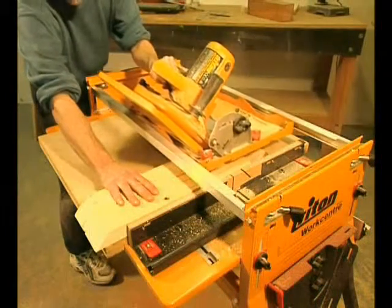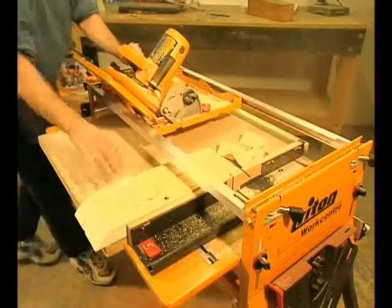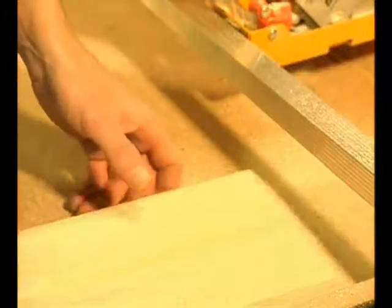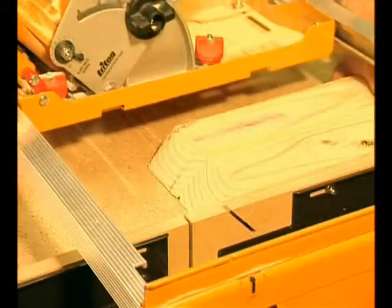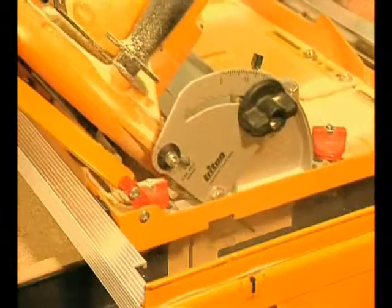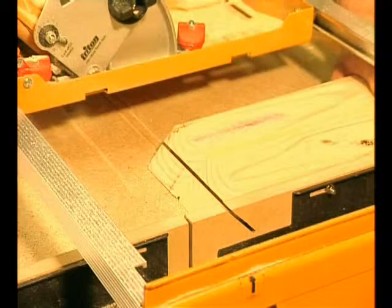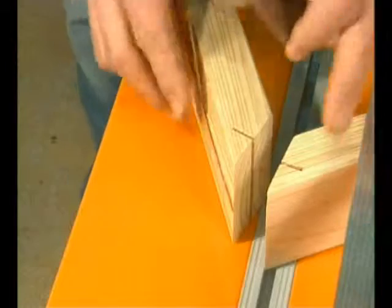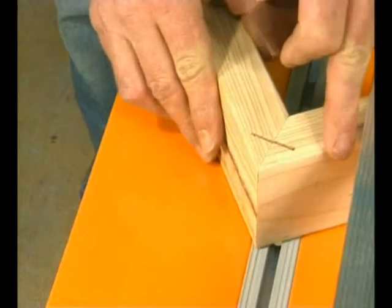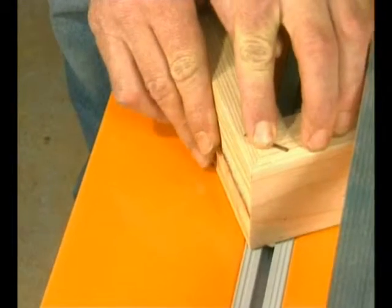The cross-cut mode is great if you're building a frame. Bevel cut the pieces two or four at a time. After you've cut one end, turn the pieces around, make sure they're still lined up, and cut the other end — the pieces will always come out exactly the same length. Provided your saw was correctly set at 45 degrees, your frame will be dead square. By simply feeding the wood in from the other side and raising the blade a bit, you can cut a spline groove. You'd then make yourself a spline or key, perhaps in a contrasting colour, and you've got another tight, professional joint.